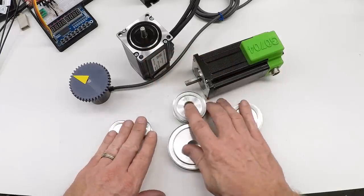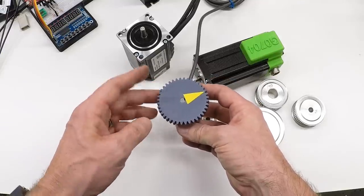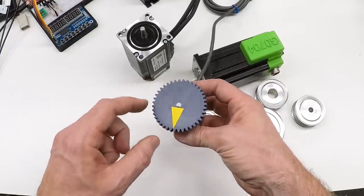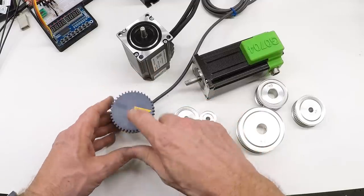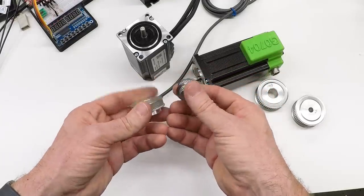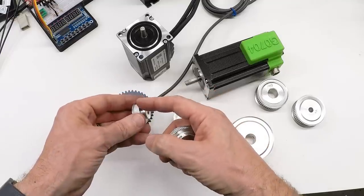I also ordered some parts to drive the encoder. The original plan was this 3D printed plastic mod-one gear that would fit directly into the initial drive gear off of the spindle through the first idler. But when I spun it up to 2400 RPM it rattled and clattered and made a horrible noise — I just couldn't get the backlash where I needed it because there was a tiny bit of runout in the gear. So I decided to go with belt drive for this as well. The HTD three millimeter is way too big for that, so I opted for GT2 — two millimeter belt, the type you typically find on 3D printers.